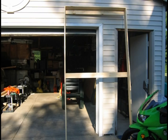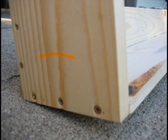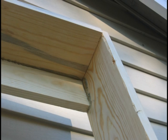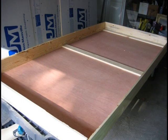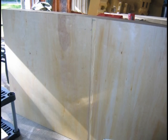This is the frame of the structure I built. In this next picture you see I went through and did a lot of gluing and screwing — I used wood glue and screwed everything in, made it nice and tight and secure. I put support on the upper and lower areas of the panel, as well as ran one straight across the center. Next I went and put Luon — it's a thin pressed board — on the back, and I glued it on and tacked it in with brad nails.